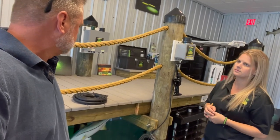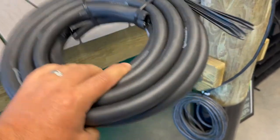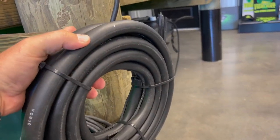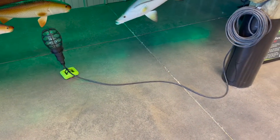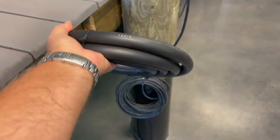So you just saw the pitch for the accessories and I'm going to do it — for two reasons: she's right about fishing, and I do have some barnacles growing that you'll see during the installation. I'm going to run the wire from the high water line all the way down to the mud and as far over as I can, which should provide protection from the cord chafing and also from the fishing reality that people are going to find the lights and fish them. Very good tip.